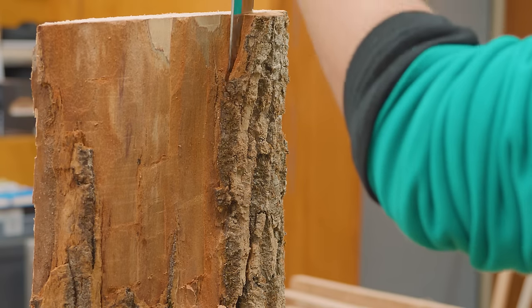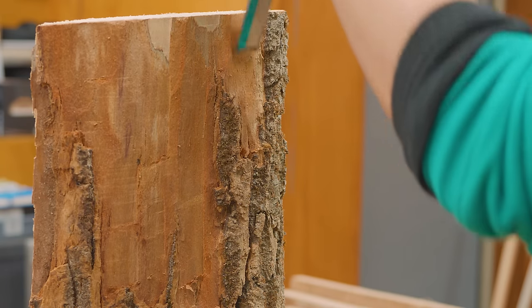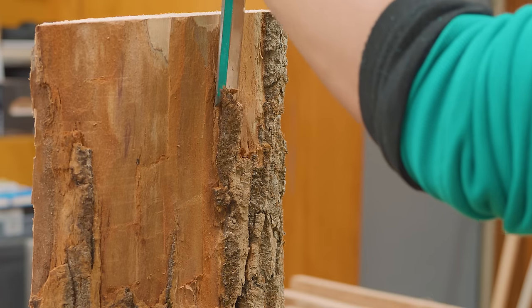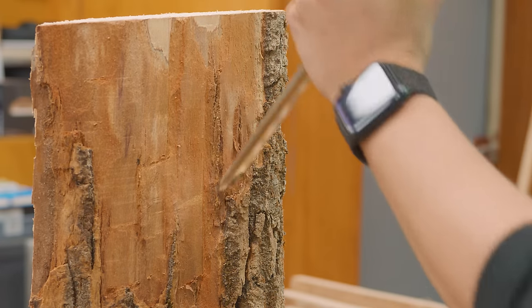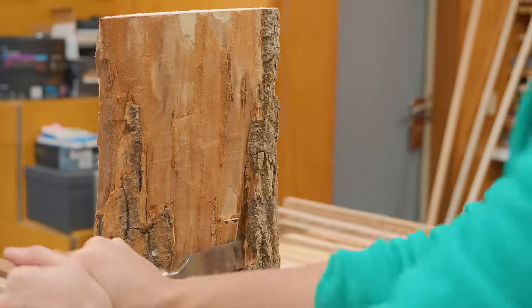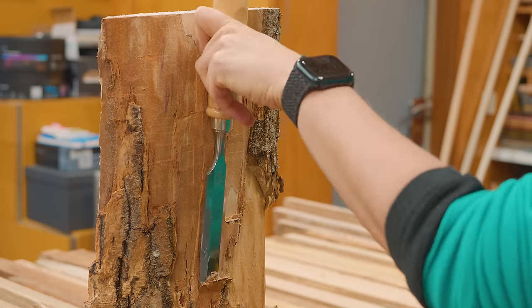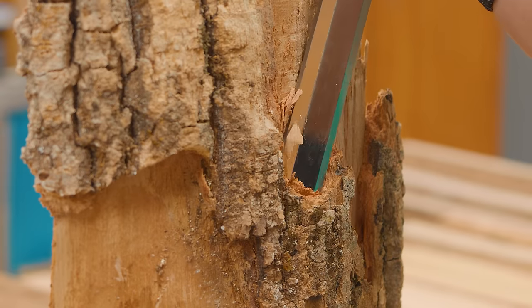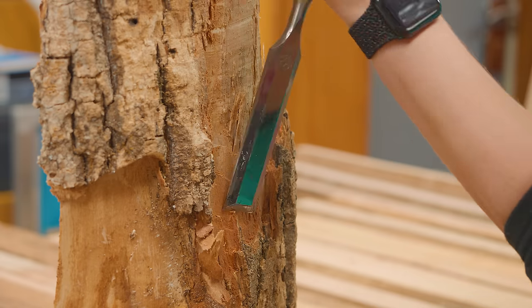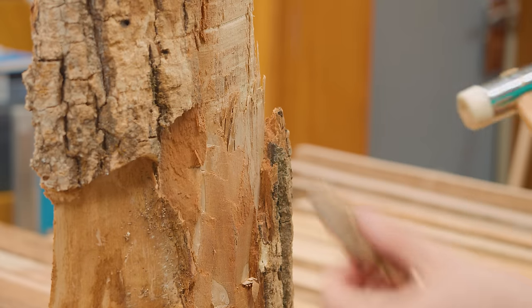They also brought some outer cutoffs from ash logs that I tried to salvage since ash is a pretty stable wood. It was also the widest I had, making a cool color transition in the final panel. I removed some of the bark to prevent hurting the bandsaw blade too much. The bark is typically hard and comes with dirt and debris that can quickly dull blades.